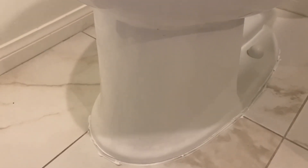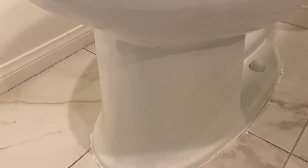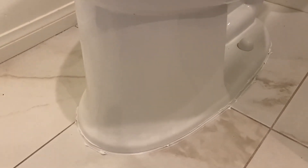Got some gloves on because I'll be putting the sealer down and removing the excess sealer with my hands, and I'll be showing you that in this video. So right now I just applied the sealer to the bottom of the toilet. Make sure when you go around there, go around the whole toilet once.